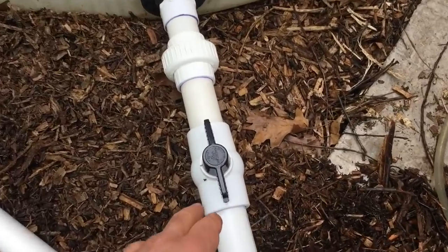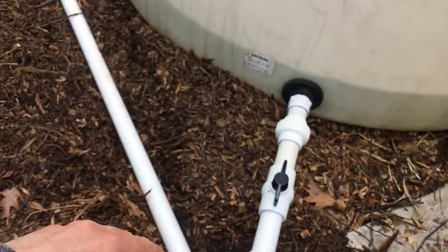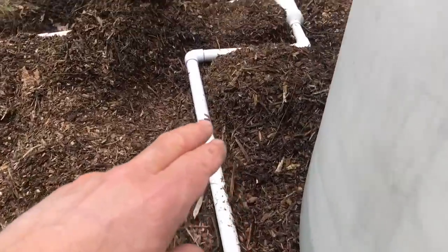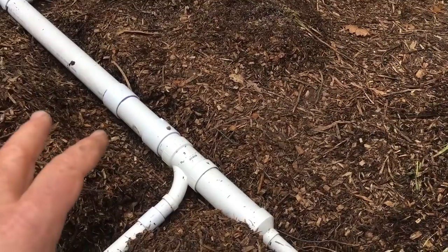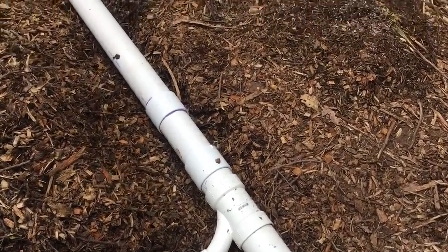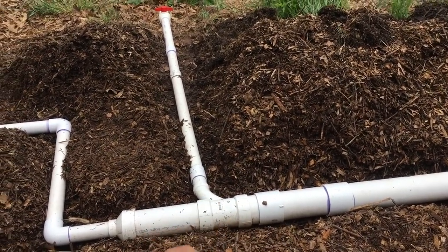I come into this T here — the T comes up to this valve, which goes into a quick disconnect, so I can remove the tank and do maintenance if needed. This one tank here will store 1,550 gallons of water, and that feeds into this line which comes along and then feeds into a four-inch pipe. The reason I have four-inch pipe is because I have two two-inch feeds coming together, and I need to handle overflow during downpours. We do get a lot of thundershowers in this area.